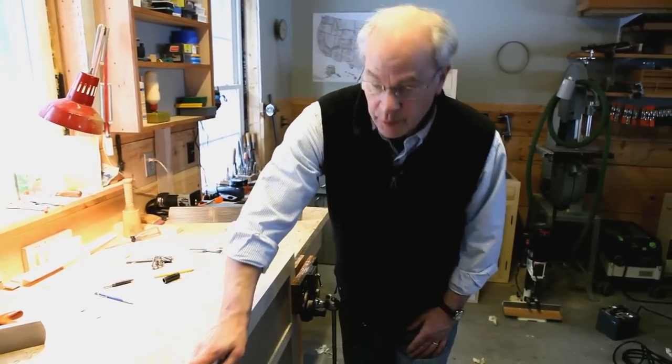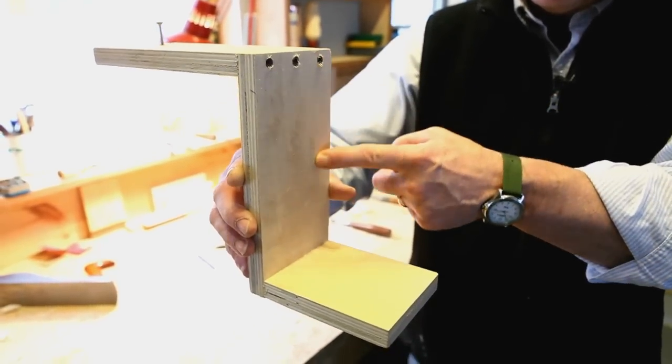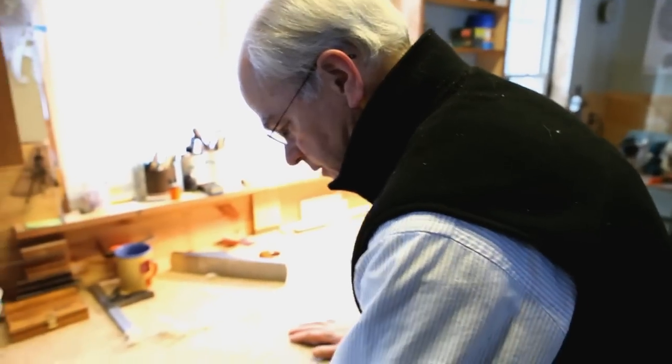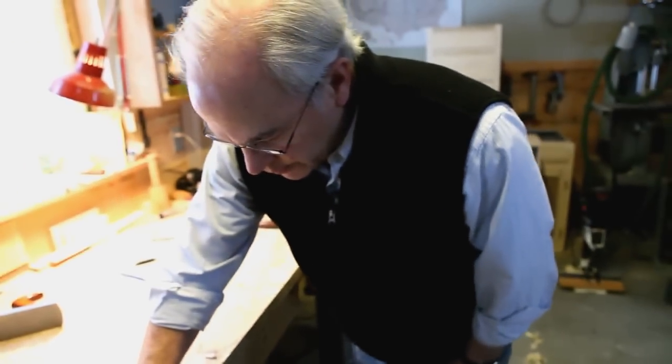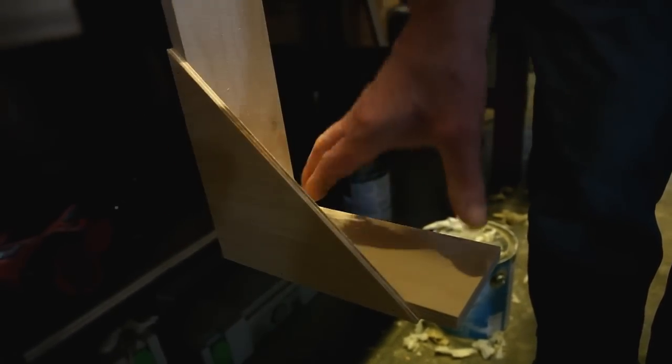And you can really press down with a plane. They're really simple to do. It just consists of three pieces of scrap plywood: one that goes over the top of the bench, the vertical piece that's sort of geared to the size of the door, and a little shelf for the door to sit on. So if the door is a heavy door and you want a little bit of stability on that bottom leg, you can just add a little gusset here at the bottom, and that'll keep it nice and stiff.